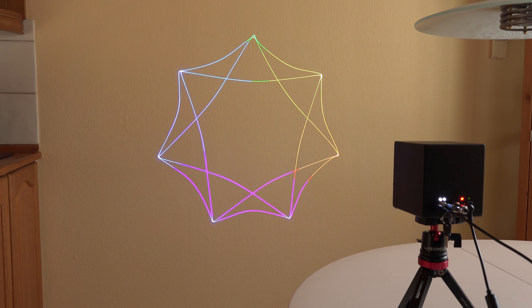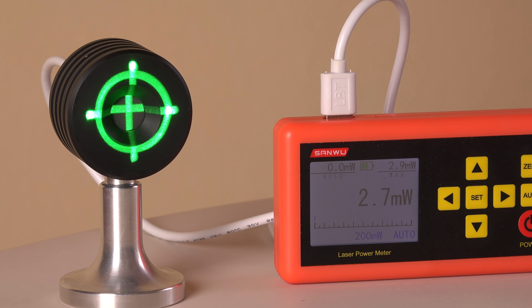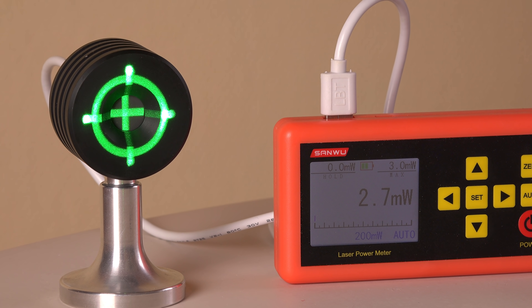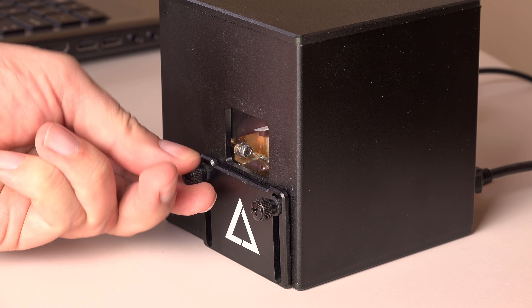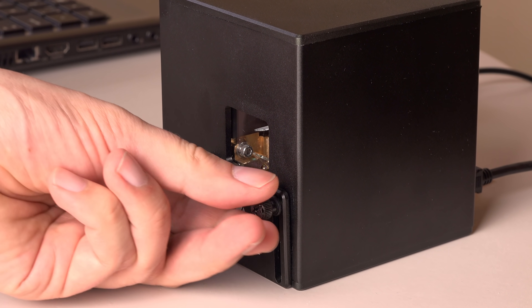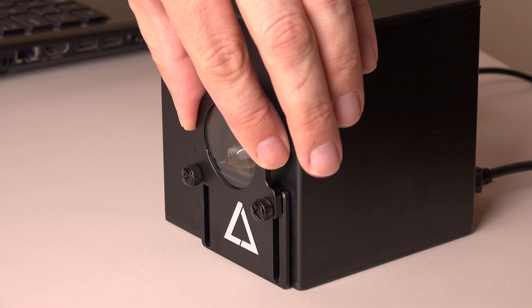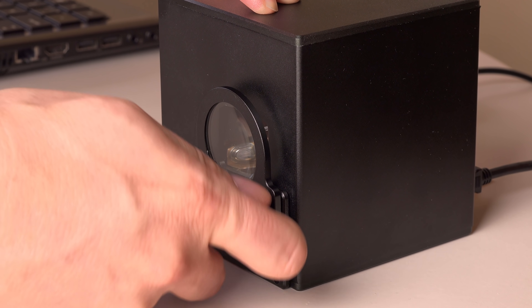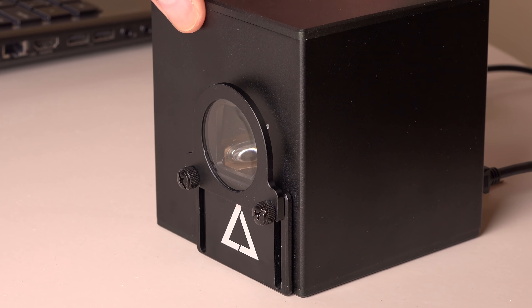Could this be real? Luckily, with the kind help from my patrons I bought a laser power meter so we can test it. Thanks to all my patrons for making this possible. It is not recommended to fire a focused powerful beam onto the sensor, as the laser can burn the needed coating on the sensor. So at first I mounted a focusing lens on the laser — after the focal point the beam will be spread wider, lowering the power density and making it less destructive.